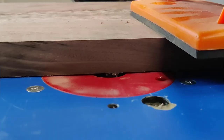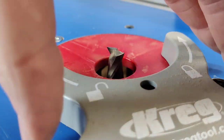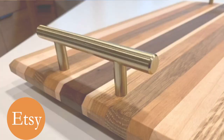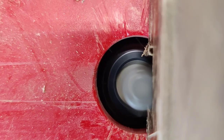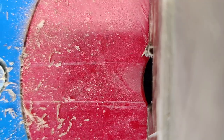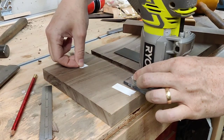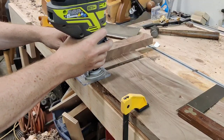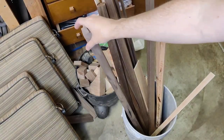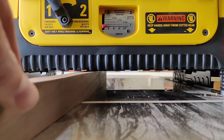To keep that crotch from cupping, I'm going to use sliding dovetails, which will double as feet to stand the board up off the counter, making it easier to carry without screwing on some metal handles.